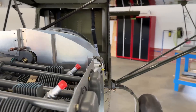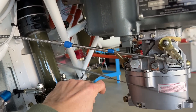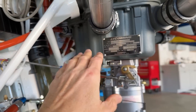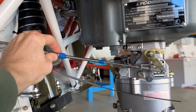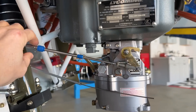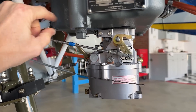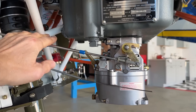Let me go on this side because I can show you my throttle cable and my mixture cable. I wanted to get this stuff done. On a previous video I had this clamped to the engine mount right here — this is where it gets clamped and secured. Some people said when the engine moves it could change the throttle, which is possible. So I took that clamp off, but I have a feeling that's pretty much the only way to do this. Even if the engine does move, it's not really making any difference. I think the only time the engine's going to move is maybe during a start. Once I get this on, I'll see if there's some kind of bracket — technically this should be attached to the engine so no matter how the engine moves the throttle isn't moving. But there's just nowhere to attach it on the engine, so we'll figure that part out later.